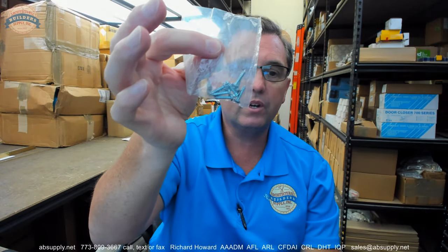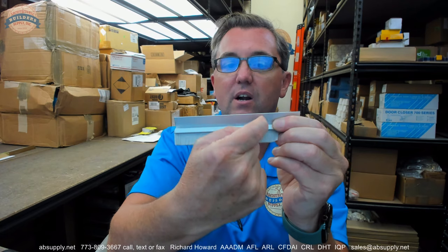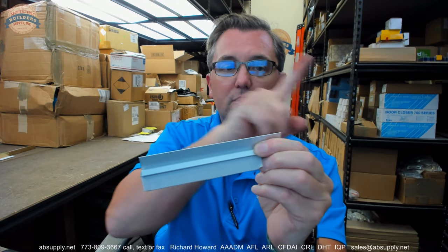It comes with fasteners — slotted holes at a particular distance from the edge, with so many slotted holes down the way. Generally there's one more hole per foot, so a seven foot piece should have about eight holes — a general rule of thumb, not absolute. You can order any length you want; we have the site listed from two foot to eight foot. Past three feet the shipping cost changes because of carrier rules concerning length, so don't order eight foot pieces when you need a bunch of 32 inch pieces — order three foot pieces if you're going to cut them down. I recommend ordering them the actual size, as they'll cut it to the right length and provide the slotted hole at the proper distance and proper center to center.